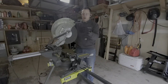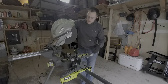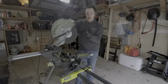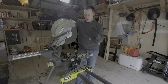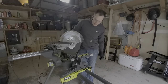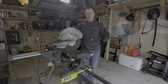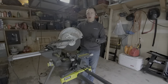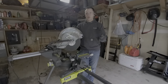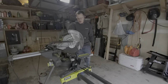What I've got on here is a 12-inch grinding wheel. You can pick these up at Home Depot, Harbor Freight, or wherever. I'm going to show you how it cuts first, and then I'm going to show you how to set it up. One thing to note: once you get it set up with the arbor I have, your laser is going to be a little bit off to the left. Because of the arbor, it offsets the blade just a little bit, so when you're making your cuts, you have to account for that.